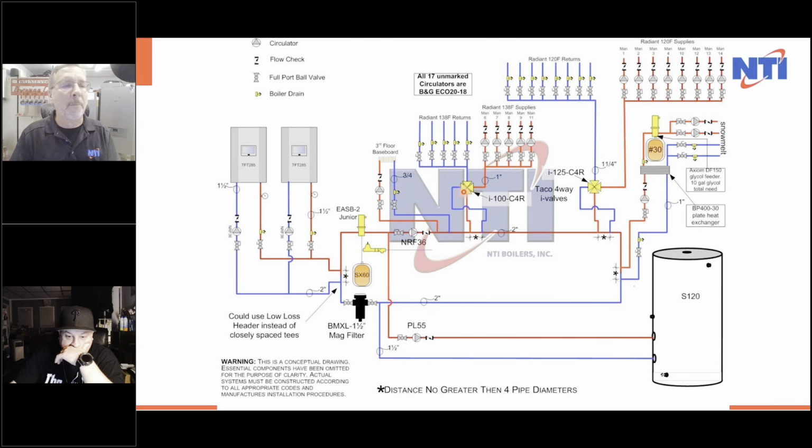Goes up to the mixing valve, opens and closes. I can circulate around here, off it goes, bypasses, goes around. We have exactly 138 degrees on the coldest day. Keeps on going, comes back. I'm still up 178 degrees coming through here. These zones call with 120 degrees. Now I'm returning colder water, having a great time. I'm still mixing down. I'm still at 165 degrees coming off this. We need to have 135 going out to the snowmelt, 138 degrees going to the snowmelt. No big deal. Even if all zones are calling, I still have 175 degrees going out to this thing. And everybody's having a great time playing in the right sandbox.